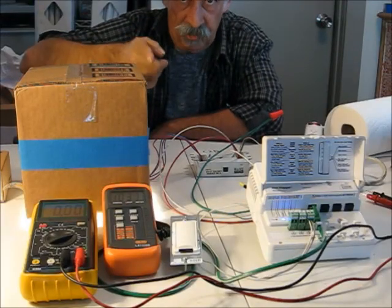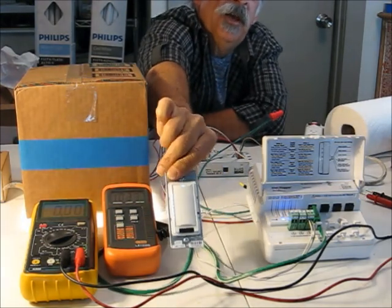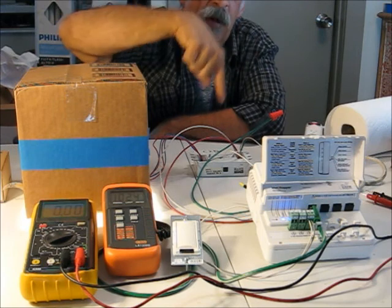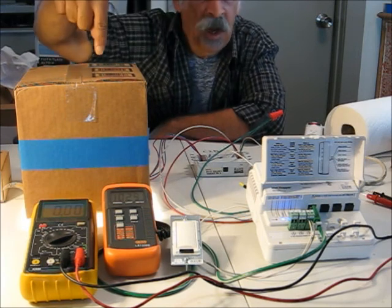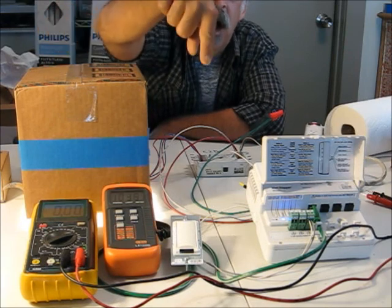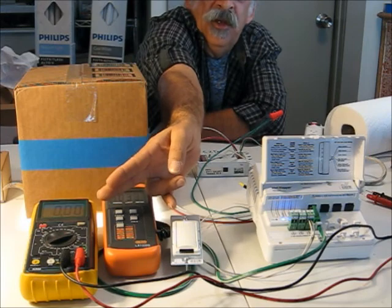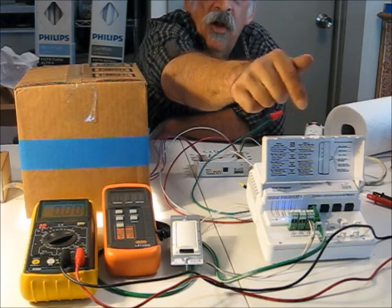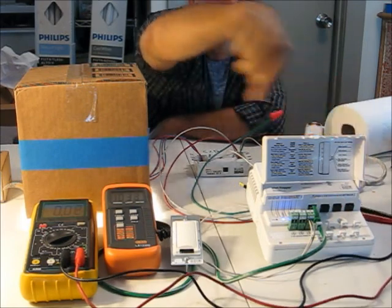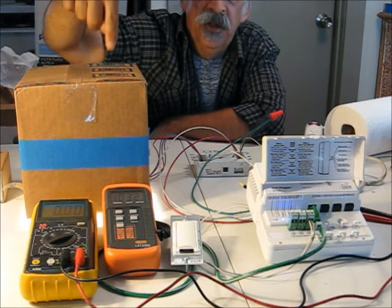Hi, my name's Bob Shearer, and today we are going to look at trimming in a multi-level area control on a 0 to 10 volt system. I have a 0 to 10 volt ballast here. I have a CFL inside this carefully calibrated cardboard box. I have a meter to read the control voltage straight off the terminals of the control device. There are the leads. And I have a light meter to read the output from the lamp.